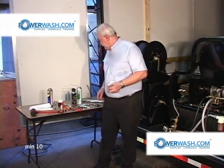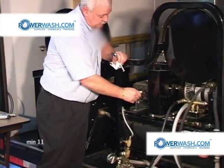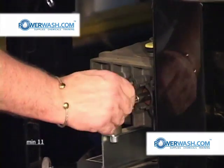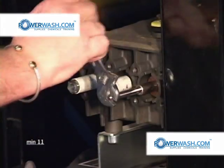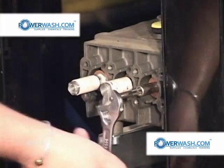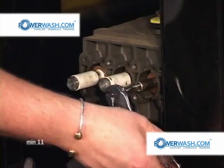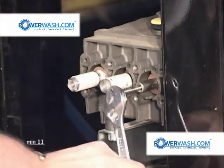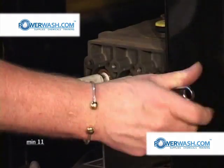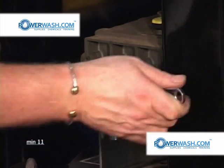The next item is to chase out the threads. This is an 8mm, 1.25 pitch tap. If you can find a bottoming tap, it's better — I don't happen to have one at this point, but this will work. Just slowly run it in and cut that old Loctite out of the threads. You may feel it get a little bit snug at times; when you do, just stop and reverse your turn on it and then run it on in. Do this carefully, because at a certain point it's going to bottom out on you. Once it bottoms out, back it all the way back out.